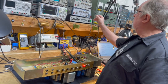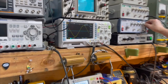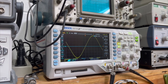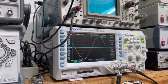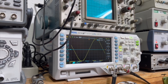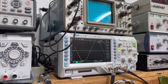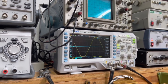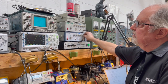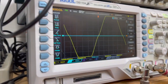We're just going to show that when we bring the signal up on the scope, this is about 100 watts right here. Look at that. It's not even clipping, right? It's not even remotely clipping. Now, we're actually getting past the range of my scope to see the ripple. Wow. But the way we know that we're achieving maximum power output of the power supply in this thing is we start to see the crossover distortion get introduced into it there.